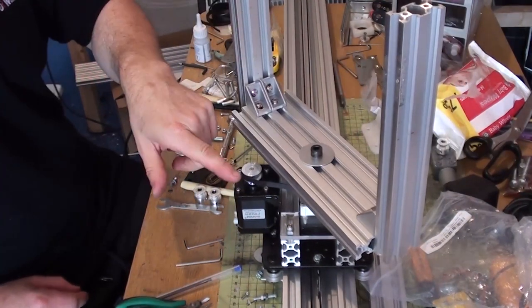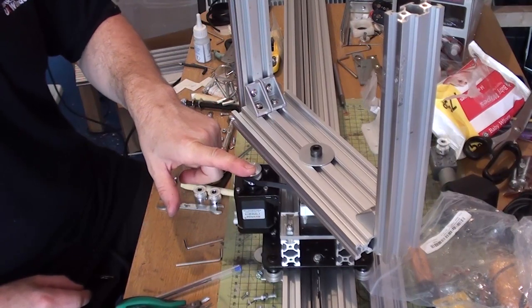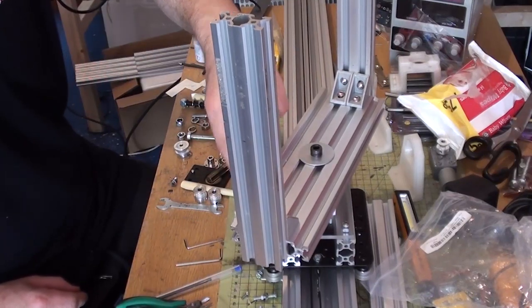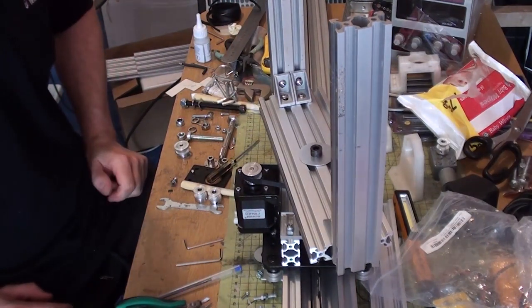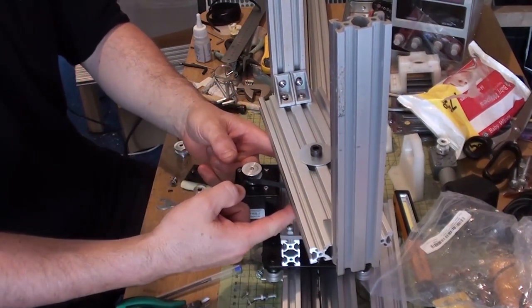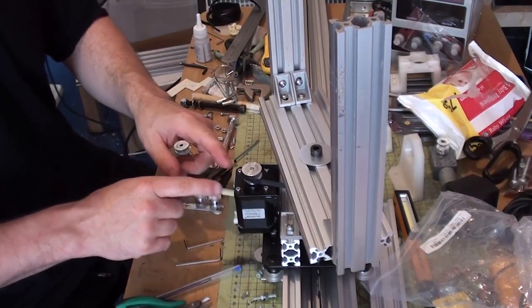Now, right now, I've got this on the timing belt here. Timing belt, I had to make myself. There isn't a timing belt that comes in at that size. I've got one on order, which should fit. It's going to be very tight though. I mean, it's going to be a case of I'm going to have to put it over the large cog first, put the whole assembly together, and then test, see if it'll actually go in.